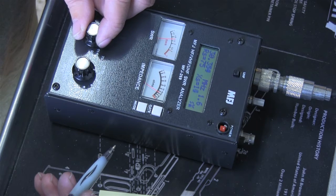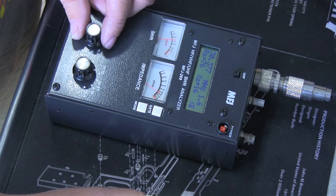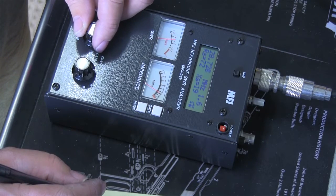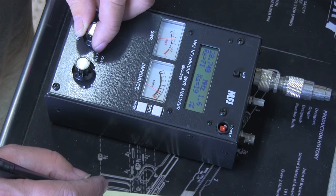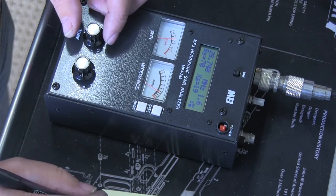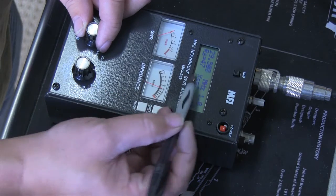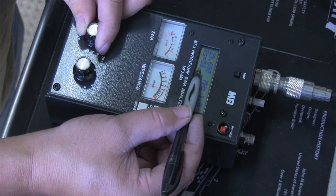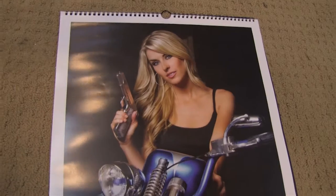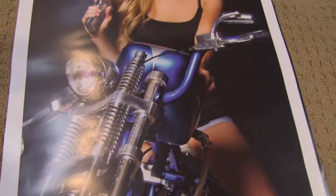We're going to go down in the band and it's already dropping really fast. We're at 1.7... we'll start at 1.6. We have 30.3 — we'll call it 30 — down to, and then climb it back up to 1.6, which is 28.75. So that tells me that the antenna is a little bit short on 10 meters. Let's see what the perfect resonance level is. We're at 50, which is matching the impedance line — 1.0 SWR at 29.65 MHz. So 29.65 is the resonance level of the antenna. I made a note of that and now we'll continue on.